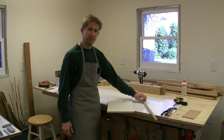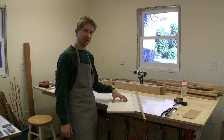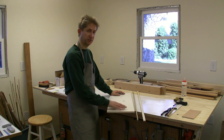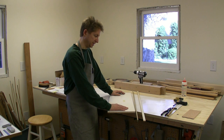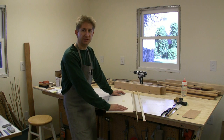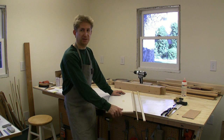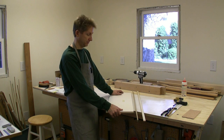I thought I would create a video to show how I glue my trim to my sheet goods, and more importantly how I trim the edging to be perfectly flush with your sheet goods. I use the same process for my plywood sheet goods, but it's obviously easier to do that with plywood because you can machine it and sand it. With melamine, you can't let any of your tools touch the melamine surface, otherwise you destroy the surface — either you have to begin again, or put up with something that's just not going to look as good.